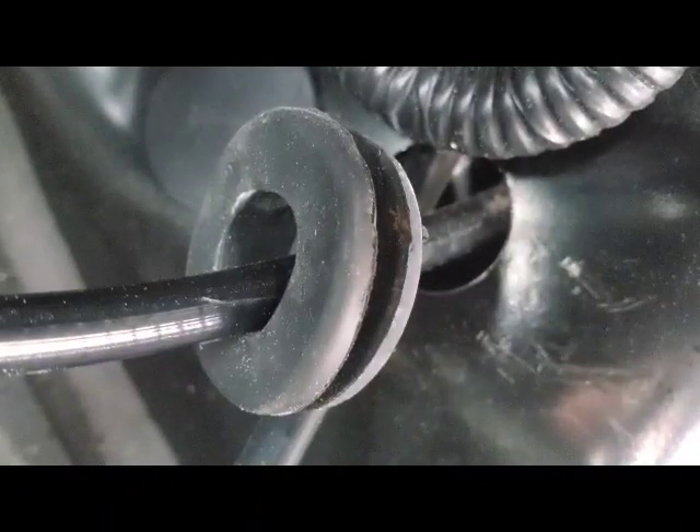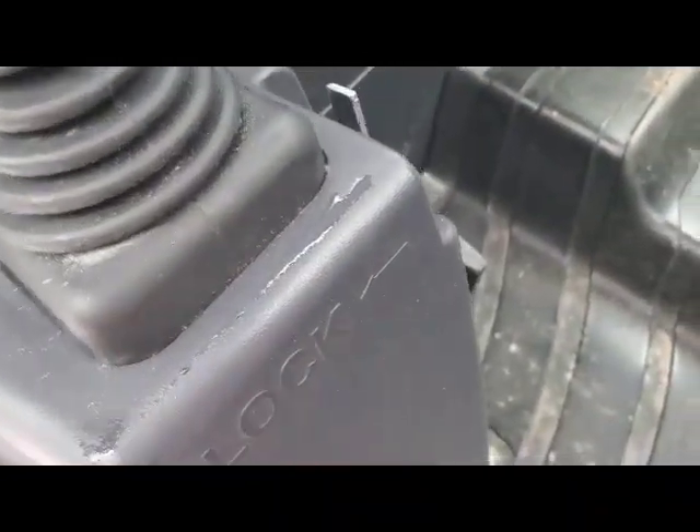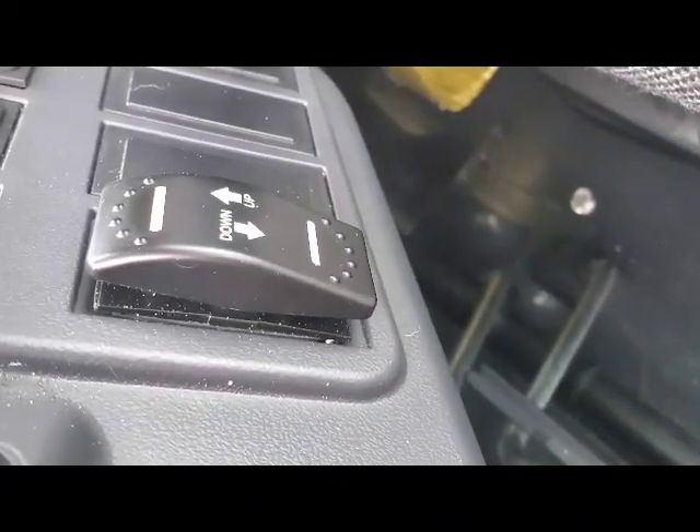To get through the firewall - the cabs on these are very, very tight - I took this little cable, I believe it's emergency brake cable, pulled the grommet out, and squeezed my cable through that tiny hole. Ran it under the floor mats, removed my joystick cover which is three bolts: one here, one here, another hidden one - 12 millimeter. When you lift it up, ran my cable up through here and into my console, which I've left disassembled to show you the wiring.